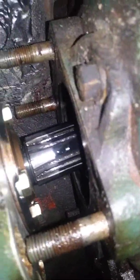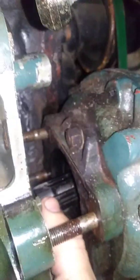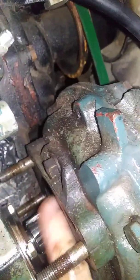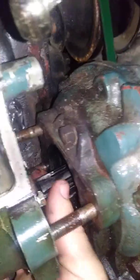There's a mark right there and a mark right there on the pump. You're not going to be able to position the pump wherever you want because the springs — the cam is going to try to compress the springs and roll wherever it wants. What you do is set the pump where that tooth is happy, up straight-ish, then just roll the motor and get that slit in there and you're good to go. Right now I'm off a tooth, so I'm going to roll that back up.